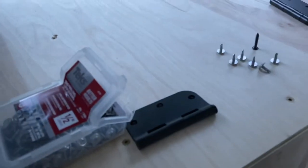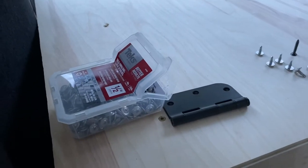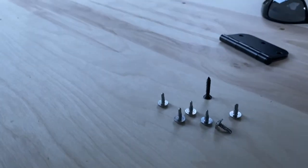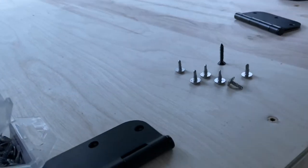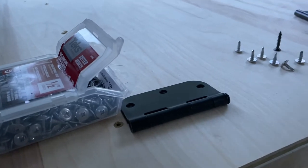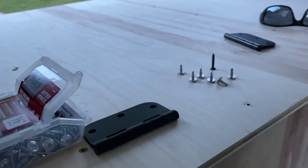I ran into another snag. I'm using door hinges for the fold-outs and everything, but I think I'm going to switch to piano hinges for the main bed frame because they are too far spaced. I think the door hinges are going to work for the fold-outs because they have a lot of play in them, which allows me to wiggle them over the seats just fine. The problem is the screws that came with them are too long — they actually stick out of the back of the box past the plates I'm putting them in. So that's not going to work. I'm going to try and find some smaller screws tomorrow. I tried wood screws I picked up and those are a definite no — the heads stick out because they're not chamfered down flat, and they cause it to not work either. I'm going to check out piano hinges for both anyway and see if that would work.